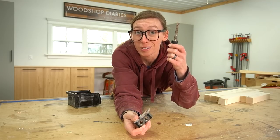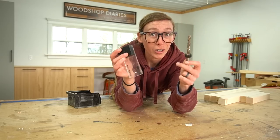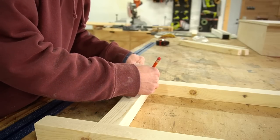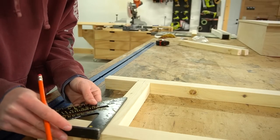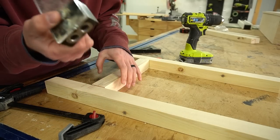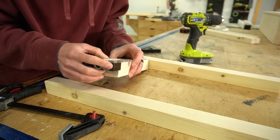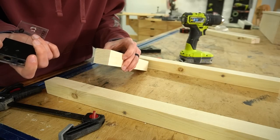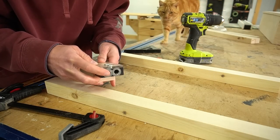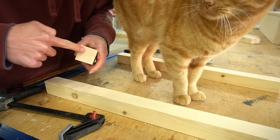The bit that comes with the jig has a little stop collar on it, so you set it to the depth you want to drill — very simple. I laid out my sides first, which consisted of two legs and a runner between them. I positioned the runner about four inches up from the bottom of each leg and used a square to make a mark on each side so I knew where to drill the dowels. I drilled two holes on each face, which will be slightly off-center but it'll be fine since we're not holding hundreds of pounds of weight here.